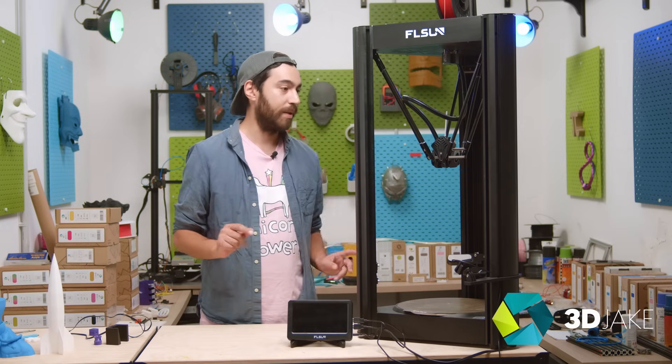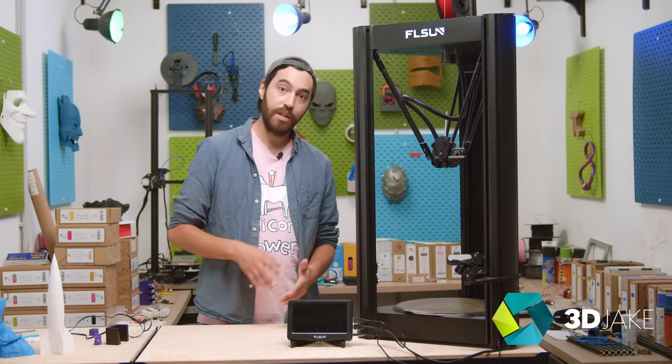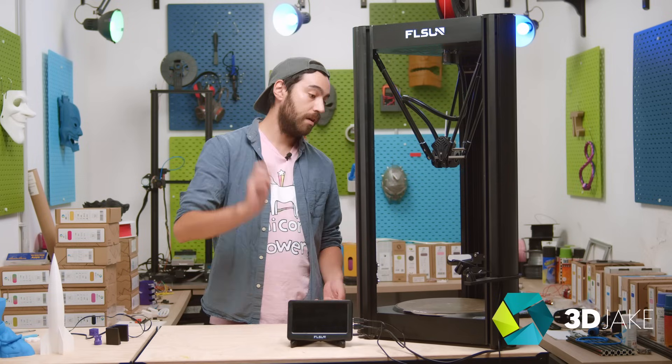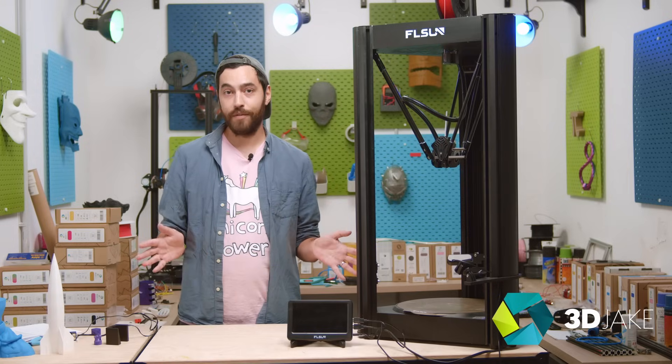So what's good about this printer? Let's forget about my whole Delta thing for a minute. It has an all-metal hotend, a volcano all-metal hotend, direct drive on a Delta, Klipper, high speed, Wi-Fi web interface, a filament sensor, auto level function — it has so many features, it's great. If you want to compare it against something similar in build volume, you could compare it to the CR10S Pro V2 which has 300 by 300 and 400 in the Z — but that's actually a smaller printer in terms of footprint. You can't compare a Delta with Klipper to something like a CR10S Pro or any other Cartesian printer — it's miles ahead. If you'd like any more information, drop a comment below or contact us via email. Don't forget to like and subscribe and I'll see you next time.